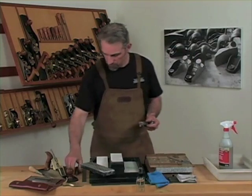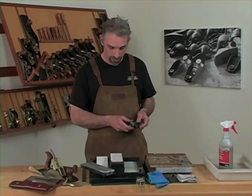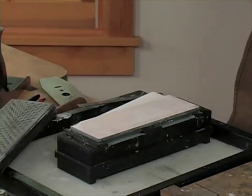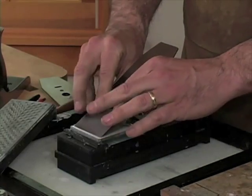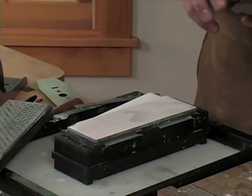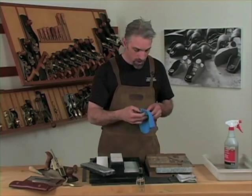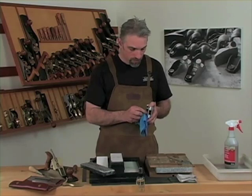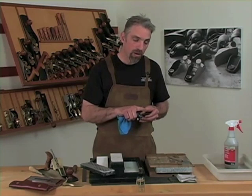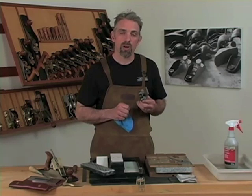Set your distance and tighten down the jig so that the blade will not shift. Then with a little spritz of water on the stone, four passes on the 1000 grit stone should give you a burr or wire edge on the back of the blade. This burr is an indicator that you've brought fresh metal to your edge. If you can feel a burr all the way along, then when you hone on the 8000 grit stone, you've got that edge as sharp as it can be.